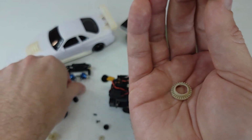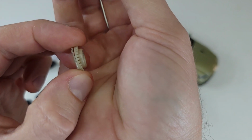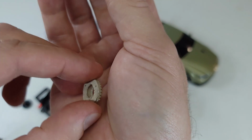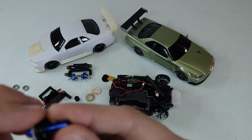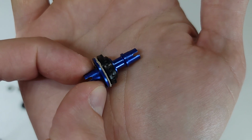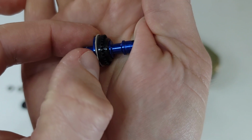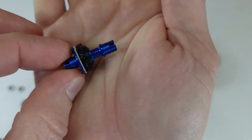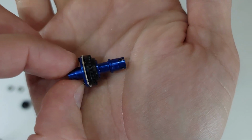All I have to do is put one of these little shims with it for the 14, and then if I'm going to run the 16, I just take it off and run it by itself for the 16. And for the 10 and the 12, I'm using this one. So right now it's set up for the 10 tooth gear. And then if I take the little shim out of there, it'll be set up for the 12 tooth, so the 1.5 ratio.